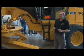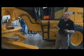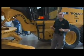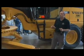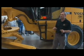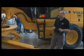I'm almost ready to start the day, but before I do that, and even though the weather might be nice outside, you want to cycle your hydraulics. Go through the cycle once, just to warm up the oil. Now that I've done that, I'm almost ready to go. What's the last thing I need to do? Put on my safety seat belt.